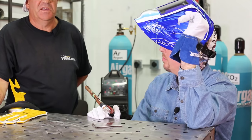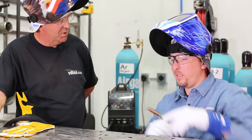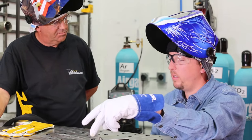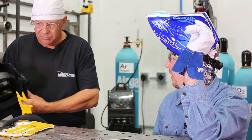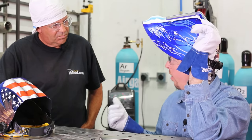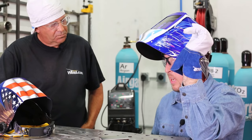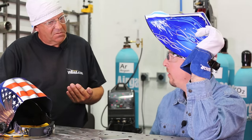I've worked with a lot of people and it seems like they have a hard time regulating the foot pedal. When they start the arc they just want to push it to the floor all the time — they're all or nothing. Do you speed through school zones? Slow down a little bit. Every pedal is a little different in sensitivity. I run a lot of different machines at work — we've got Lincolns, we've got Miller, and at home I've got the Everlast. The Everlast has the Lincoln-style sewing machine foot pedal. The Miller seems to have quite a lot of travel before you really start climbing in the higher amperage. I personally like the Lincoln — it's smaller, lower profile.